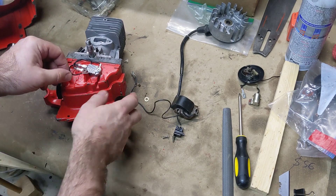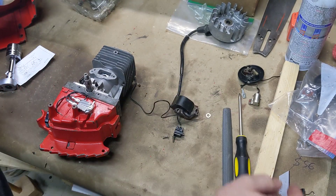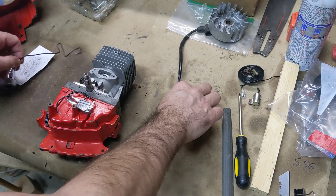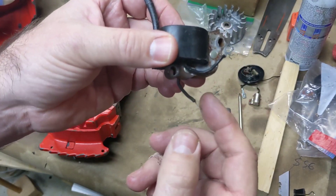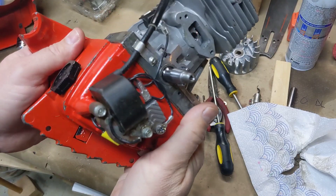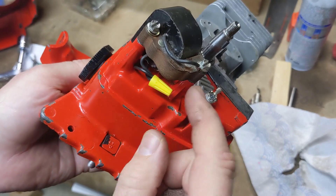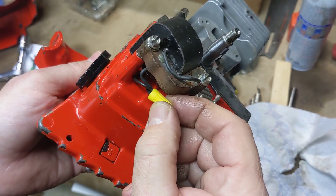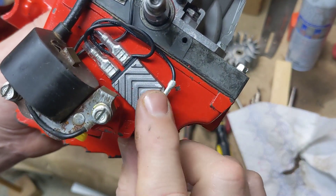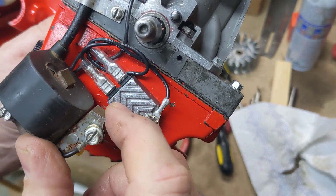This one wire is going to go to our junction, and the other one is going to go on the kill switch, come back to the junction. The third part is going to be this primary input wire. We got it all back together — I went ahead and used that twist connector instead of the other one; they kind of accomplish the same purpose, and it actually came with the chip itself. Normally I would use a crimp, even a waterproof crimp for a marine application. I moved the module over just a little bit because I felt like those connectors were a little too close to the coil and I didn't want any arcing happening across there.